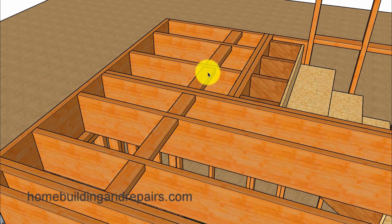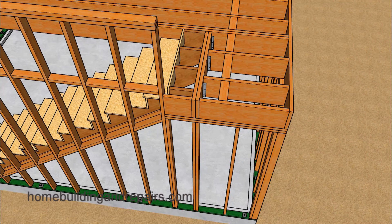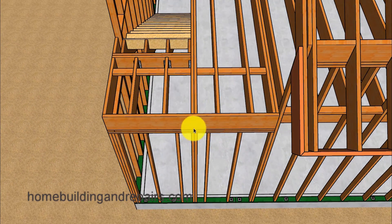In this area here, we're probably not going to be able to use tongue and groove for the floor sheathing. If I had left the floor sheathing alone, I would have ended up with about a 4-inch strip over here, because most structural engineers require a 2-foot minimum distance for the length of a piece of floor sheathing in any direction. Don't forget to install double studs underneath any point where you're going to have a doubler that will require additional structural support — that applies over here as well, and this spot here will probably need one too.